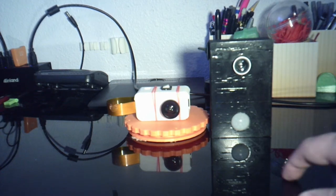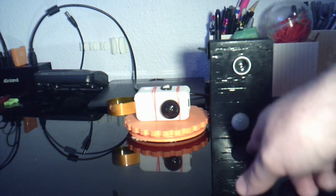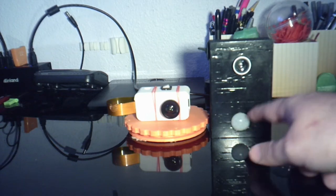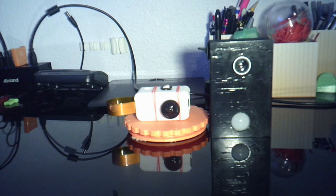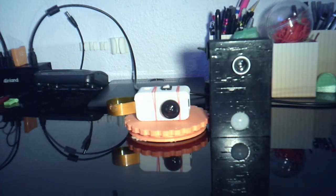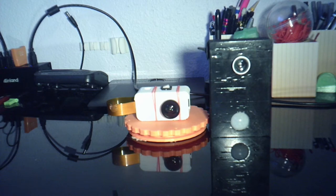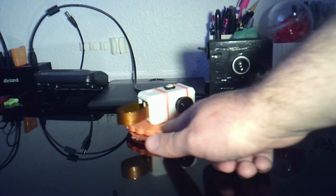You can see that I've also cut out the passive infrared sensor. Now, if you're going to do a project like this on your own, the passive infrared sensor is a pretty good way to go. It makes things really easy. Just acts like a button on the GPIO. But, in order to keep this camera nice and small, I decided to forego that and write some code that compares two images being stored in the 0W's RAM. And that's where it gets its motion information.